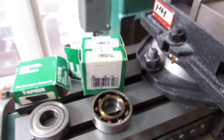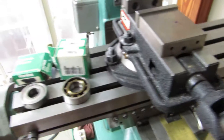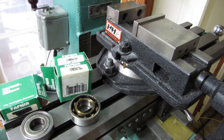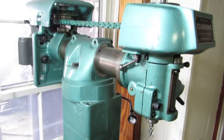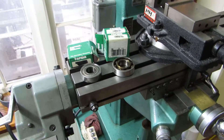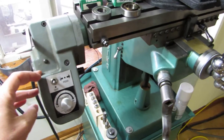To lube them up, I use a thing called Kluber grease. I don't seem to be able to find it right now — I thought I had it on hand — but Kluber grease is the proper grease to use on those bearings. Anyways, that was what I was told by my friend John Benario, who also has one of these nice little 8520s and helped me on the path while I was getting started here.